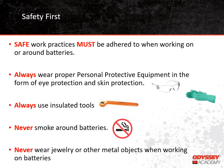The other aspect of making a good connection is to use the correct torque value when tightening it. A lot of people don't realize it, but every terminal type has a torque specification. For our batteries, you can find the torque specifications in our technical manual. You should never smoke or have any source of flame around batteries. Batteries generate hydrogen when charging. Under normal conditions with our thin plate pure lead batteries, which are valve regulated, the amount of hydrogen is minimal. But with flooded batteries, or if something goes wrong when charging valve regulated batteries, there could be enough hydrogen in the atmosphere to be ignited. It's also important that you never wear jewelry or watches when working with batteries — it's easy for a long necklace or watch to come in contact with both terminals, which creates a short.